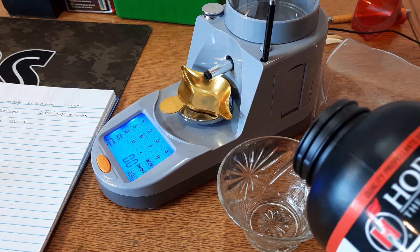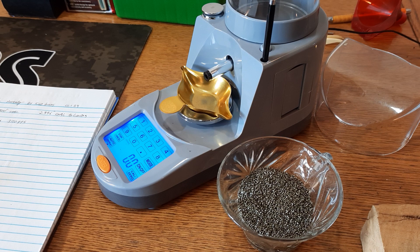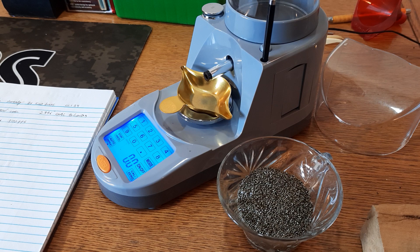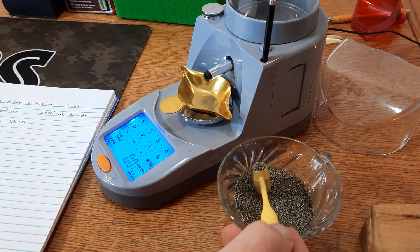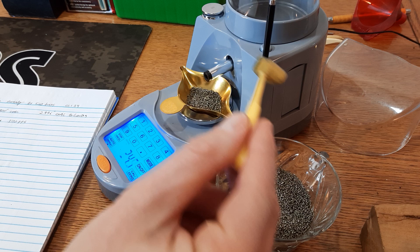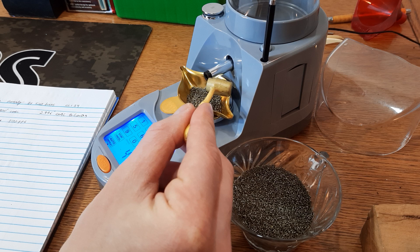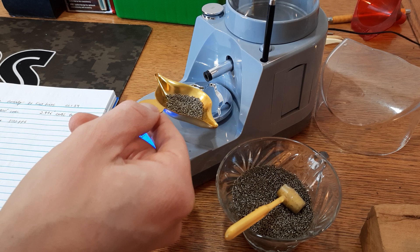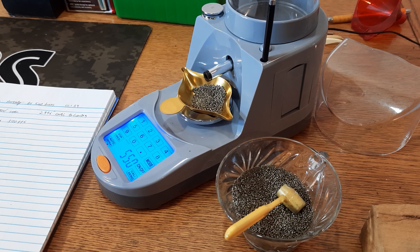What I typically do is pour a little bit of powder into a small glass jar, and when I'm just weighing out a few charges this is how I do it. I use a Lee scoop to help scoop into the pan — this is the 1.6cc scoop, which is a bit light for 6.5 PRC so it takes a lot of scoops, but it's the one I always use. A couple scoops get you near 50 grains, and we're going for 55. There's our first 55.0-grain charge.